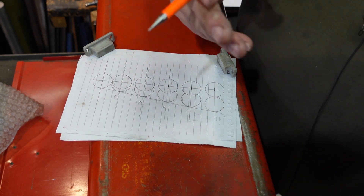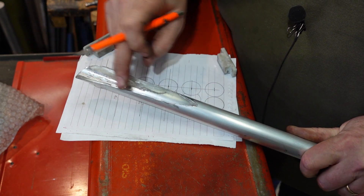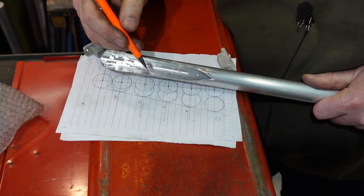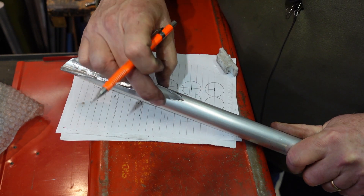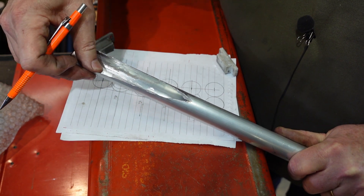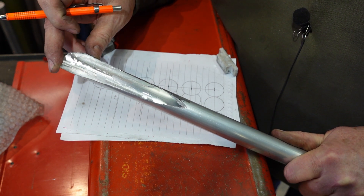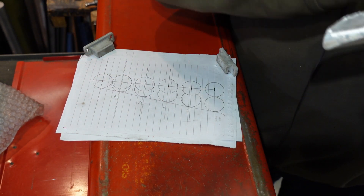I drew a circle, drew a line between the 'everything' and 'nothing' positions, then drew more circles with my circle template, worked out the distances, marked that on the tube and cut it out. So that's basically what that shape is - I knew here it had to be nothing and here it had to be a whole tube, so it was a matter of taking the measurements from there, putting marks on, measuring across, and that gave me my basic shape. I've had to bring that out a little bit to allow for material thickness, but I'll clamp that on and weld it.